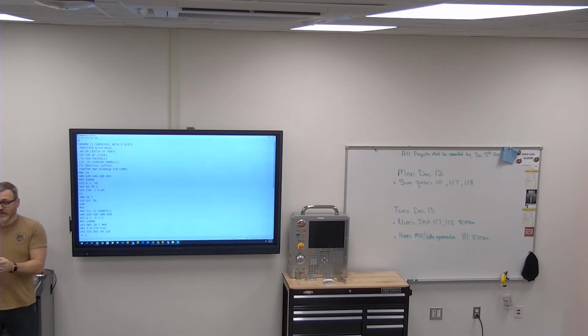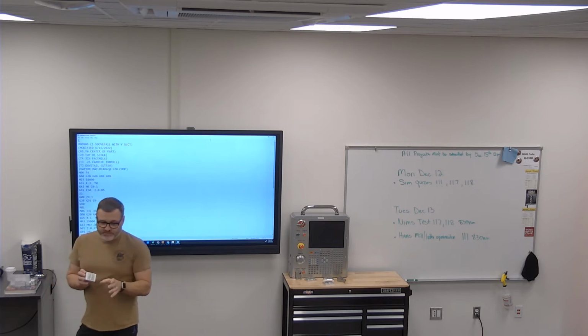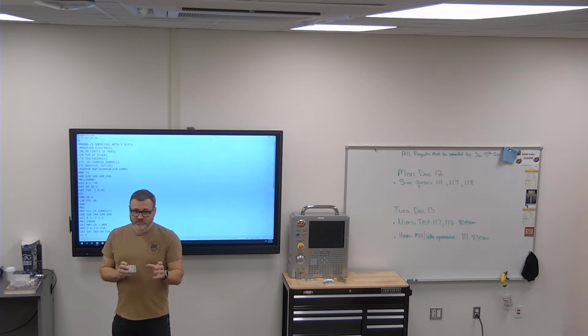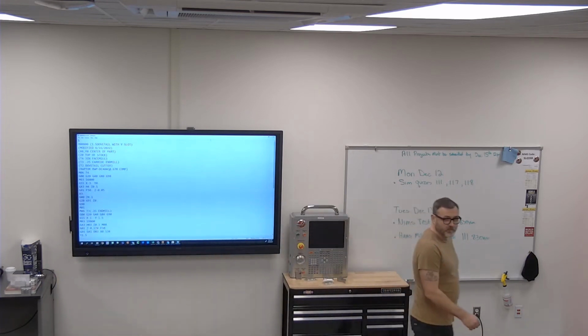Okay. You don't want to put the part in this way because it would actually still create the exact same thing. The slot would be going in the X-axis. So the outside of this part really doesn't matter. The whole point on this project is to get used to making dovetails because dovetails are how we hold lots of other parts. I'll go grab a dovetail real quick so you can see. Like in the drawer.